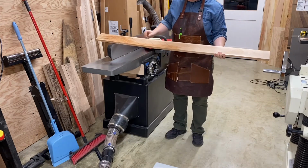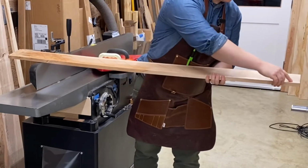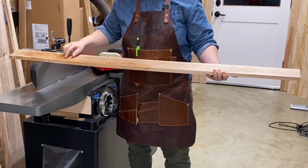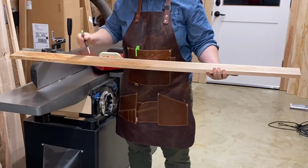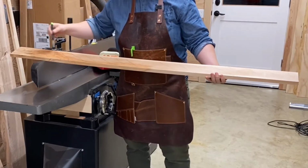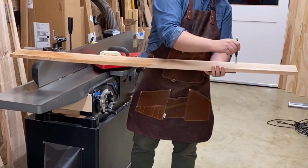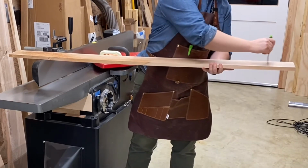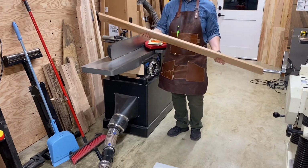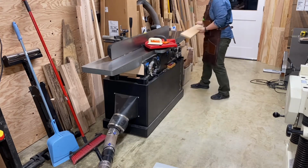Actually pretty much what I was hoping for. So I started really getting a nice reference face right here. We got a little bit on this side right here. I don't know if we actually got that or if my lines went to a stopping spot over there. But then we did get this very tail end. So I worked really hard to not press down really at all during that pass, so that the cutter head was doing it all versus me flexing the wood a ton. We'll do the same thing for this one.